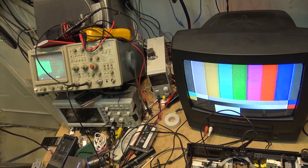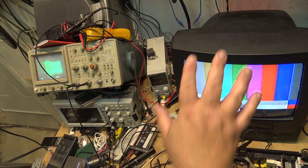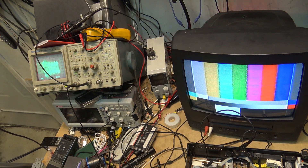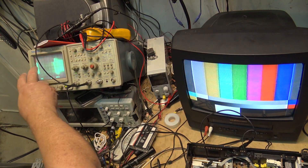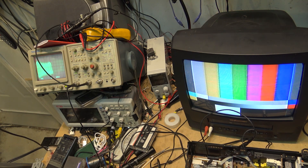But I was close — close enough to view a tape without using a scope. You don't need a scope to do it. To get it perfect, you do, but you don't need a scope to get a watchable picture. All you need is a TV — an analog monitor. Very easy to do. It can be done on a digital monitor as well, an LCD or plasma, but it's not as easy because of sync and stability problems. Confirm it with a scope if needed. Same thing applies to 8mm and Hi8.